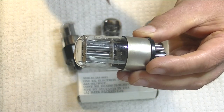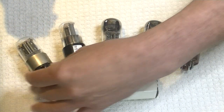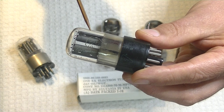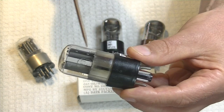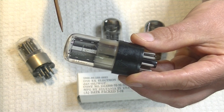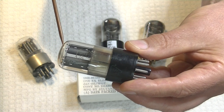We've got a typical elevated black oval T-plate, and a pair of course because there are two tubes in one envelope, with two rivets on each wing. Here's the Sylvania. If it looks familiar, it should — it looks a lot like the original 6SL7, made in the same decade, same bottom getter with a really large waist chrome. But instead of an elevated black T-plate, we have an elevated oval T-plate, which is a very common pattern for the 6SL7. The oval plate contributed to increasing the maximum gain potential of tubes.